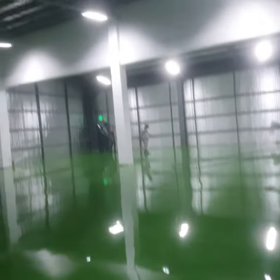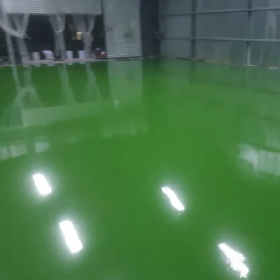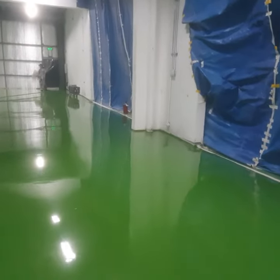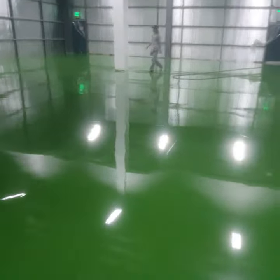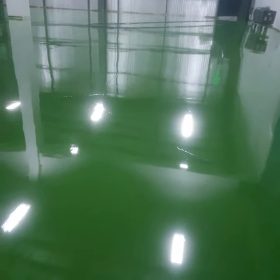So what we found also here is that there was water coming out from there, even though it didn't rain that much. And see, that's the nemesis of any coatings, may it be epoxy like this or polyurethane. So water damages the coatings while it is still at its curing stage. So we will put some buckets there, so we won't have these problems during our second coat. So we'll be sanding this one, putting some patch before we do the second coat.